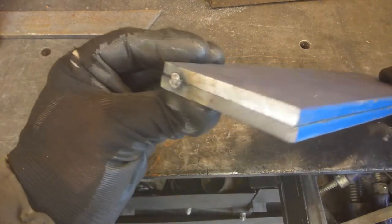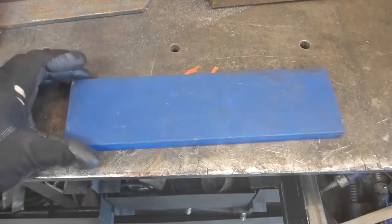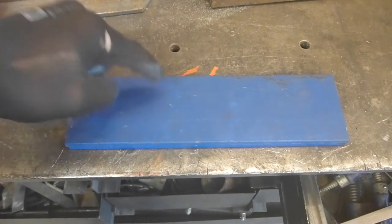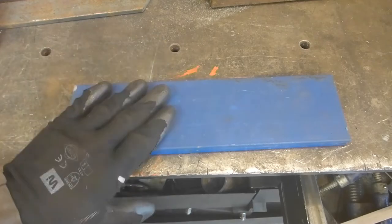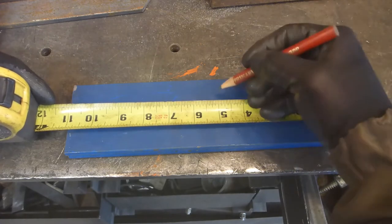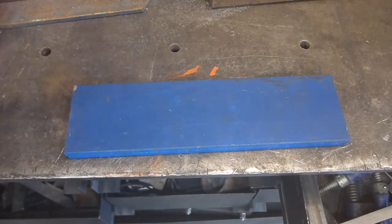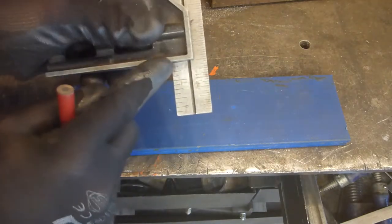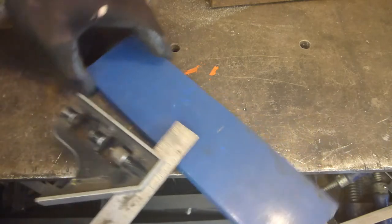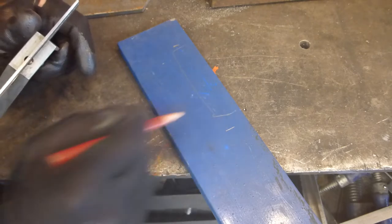Okay, I welded two plates together because I'm going to make the base of the SSQA attach system, where there will be a notch here so the pin can latch on this part. I want both parts to be exactly the same. So the notch needs to go from 5 to 9.5, and it needs to be 1.5 inches deep, like this.